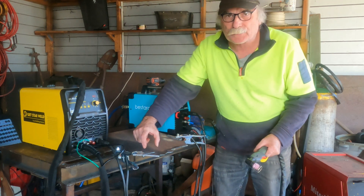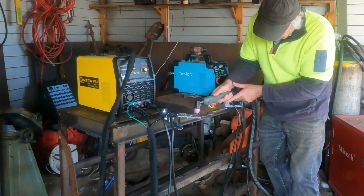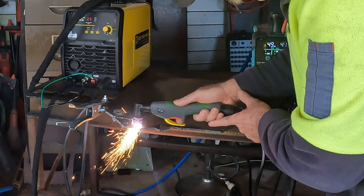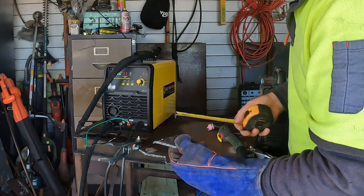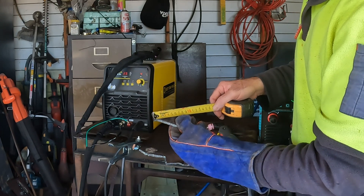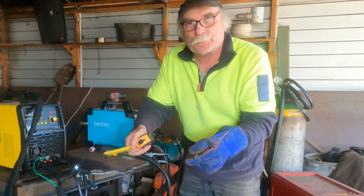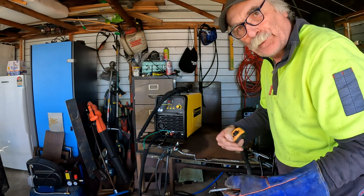So we'll be lucky if that's two inches. Let's cut that off and we can keep it as a comparison. Here we are — that's how much we cut. We're about seven and a half centimeters there, so that's two, maybe two and a half, three inches before the compressor started again. So that's how much air these things take — they take a lot of air to run. That's why you need a big compressor plus a couple of big, huge holding tanks, just so you've got a decent amount of time before the compressor cuts in and cuts out.